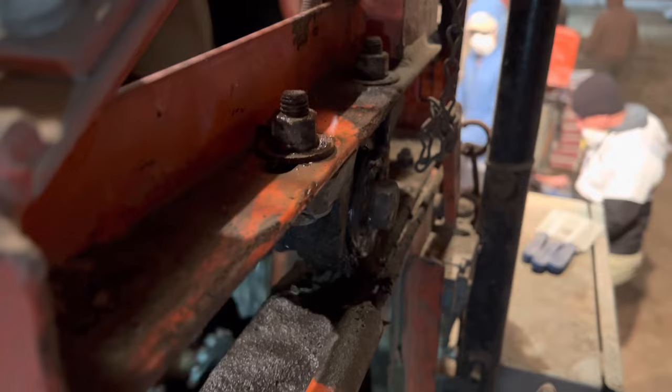I was recording and noticed that our knives weren't spinning, had them stop it. And the knives that are down in there, those are all razor sharp knives, and they had pressure on them and it wasn't turning, because there's a bolt right there on the end of that shaft that wasn't tight. It wasn't keeping pressure on the knives. So now we're back in business.